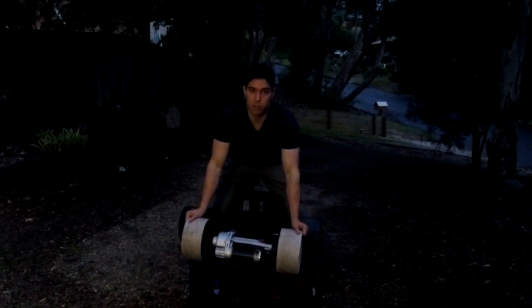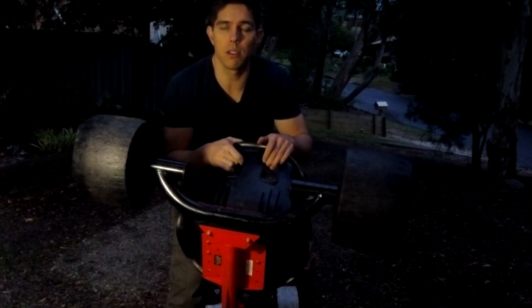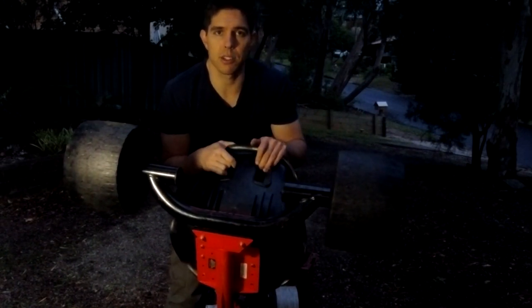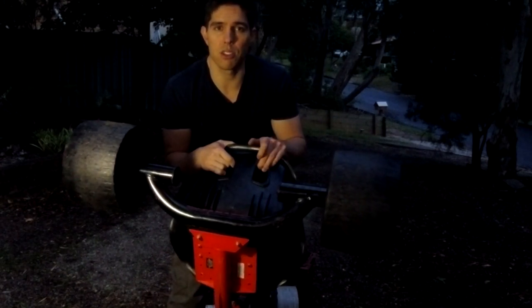You can see I'm going to lose a little bit of track, which is the width of the center line between the two wheels, but I think with a low center of gravity, it will still be stable enough and I should be able to do what I want to do. When the speed controller comes, that should be pretty straightforward to program as well. So the only hard part I'm expecting is cracking open the transmission and trying to lock the two sides. But for now, I'll try and get the frame done.